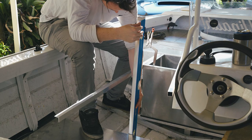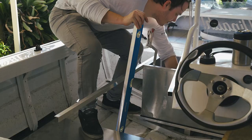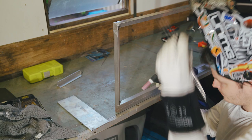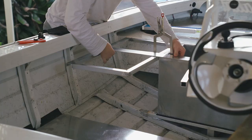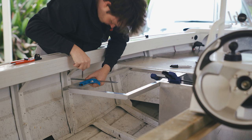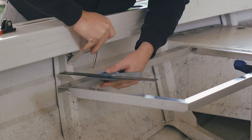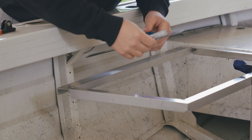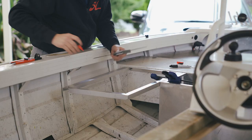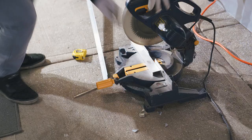The majority of the framework was constructed using 3mm x 25mm aluminium angle. This is relatively inexpensive and particularly easy to weld for a noob like me. The side frames also use a 40x20 channel on the outside edge to provide an internal vertical face to make mounting the hinge easier. As has been the aim for most of the project, I have designed the system to be removable and modular, and much of the framing was intended to be bolted together in small, manageable sections.